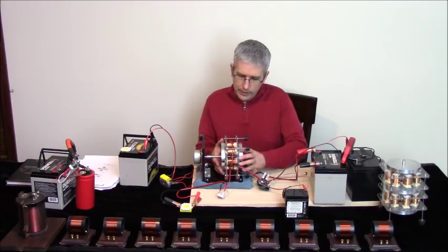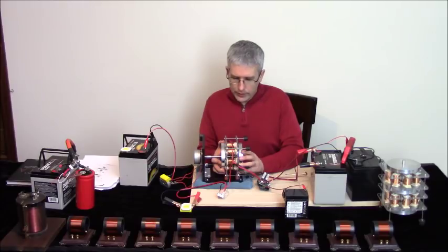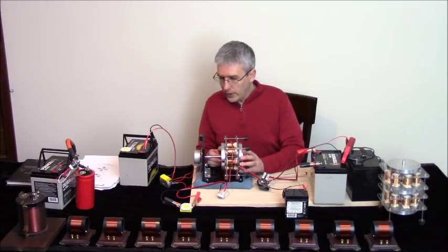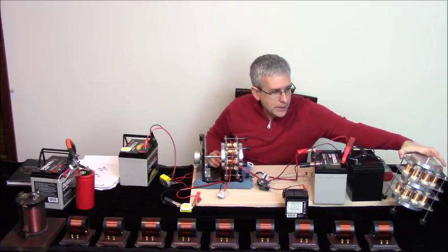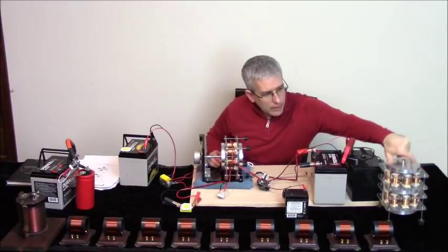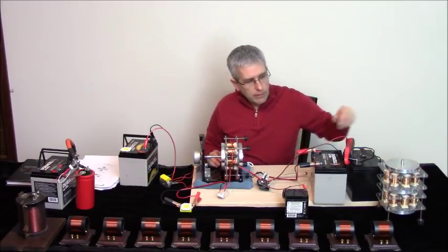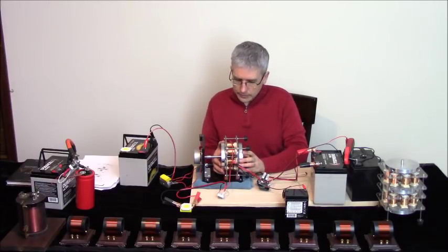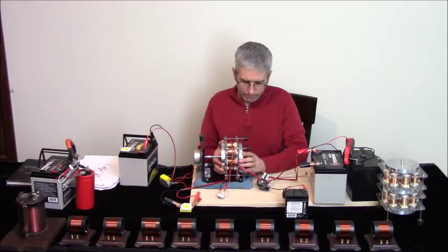This is going to be capable of probably half a horsepower. I mean, you could run this at high voltages, and you just have to replace the MOSFETs on it. Anyway, what we're doing, this is the double stack model here, and the difference is in the gap here. I've got a double spaced, 2 spacers in there, and that's probably the way people are going to normally run it, so that it's not so cogging. But this is a more powerful mode right here, but it's a lot more vibration. So I decided to show both here. Anyway, I think that's all.